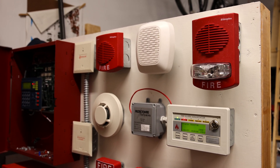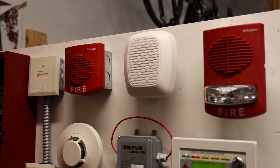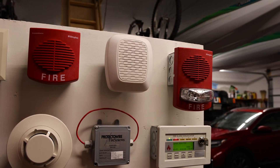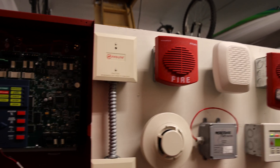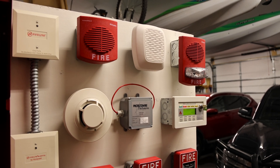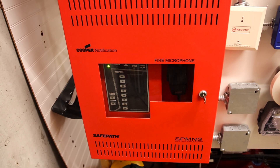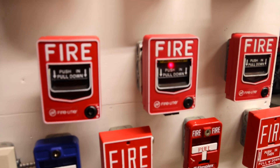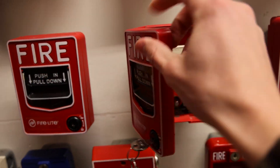Attention, attention, attention. An emergency has been reported. All occupants walk to the nearest stairway exit and walk down to your assigned re-entry floor or main lobby. That is really cool. For whatever reason the SP M&S beeps just for a second every time after I silence the alarm — it goes into trouble briefly but it goes away after just a second. We'll go ahead and reset the pull station and then reset the entire fire alarm control panel.